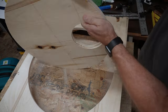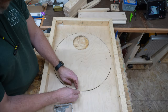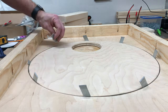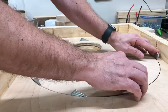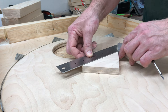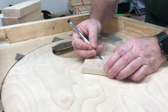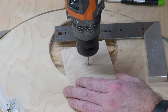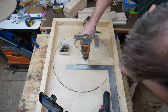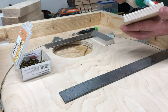What I didn't show is that I mounted the plywood to the frame before moving on to my next step, which is centering the circle we cut out back in its hole. For this, I'm just using some brad nails as spacers. It's important to get this centered, otherwise when it spins it'll be lopsided. Then I find the center point of a square 4x4 block of plywood that I actually cut out of the small circle from the target hole. Then I can line up that center hole of the block with the same center hole that was made when we cut out the big circle. I add a couple more screws so I can line that back up after adding glue on the backside of this mounting block.